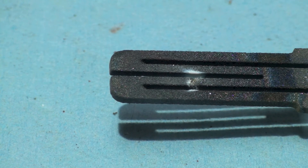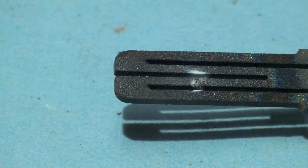You'll usually see them begin to break right there, and the resistance will go up — I've got a video on the resistance of these things I'll reference. Once it's actually broken, the resistance starts rising, and eventually it will just spark in there and stop working. Sometimes for a short time it will glow real bright right in that spot — it'll be yellow and look really hot. When you see that, it's pretty much ready to break. That's a broken hot surface igniter.